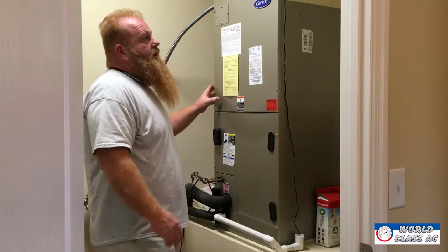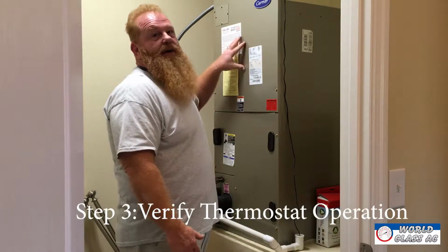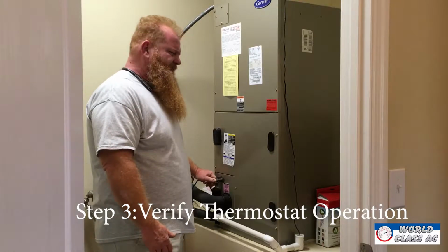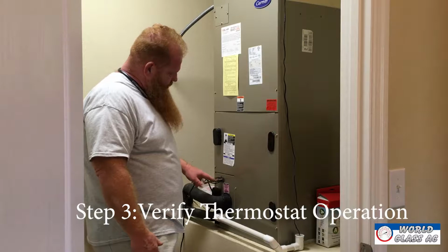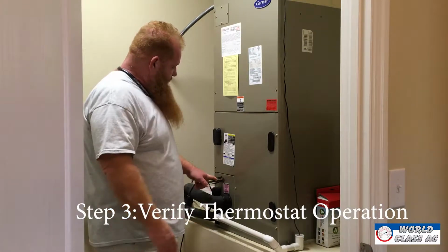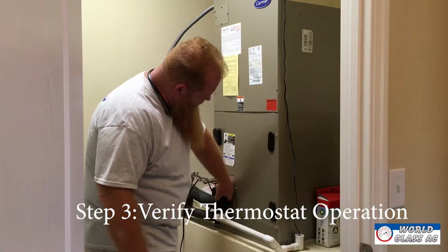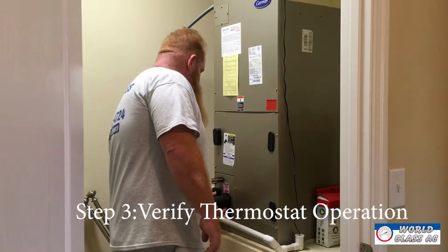So you walk in here, and if it's been a few minutes since you turned on the thermostat, you should at least hear the fan running here. If you don't feel anything, nothing running, or no even vibration noise or hissing noises or refrigerant type movement noises, which are moving through these two copper pipes here, one being insulated and one being bare. If you touch them and the outdoor unit's running, you can usually feel something from these, like this one will be warm, and I can actually touch the copper pipe here. It would actually be a little cool to the touch if it was working anywhere in the realm of normal.